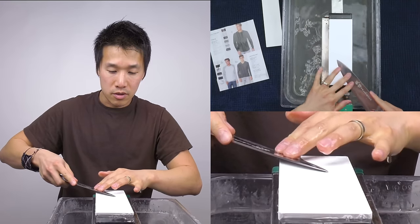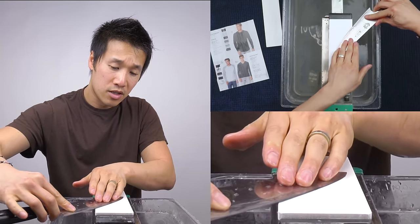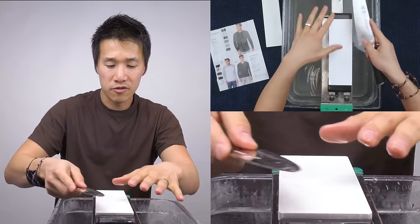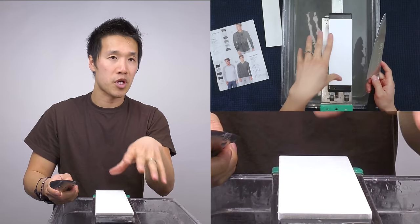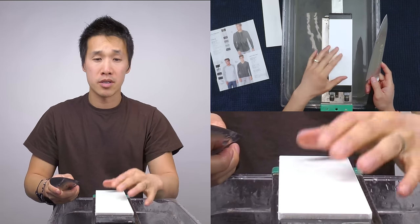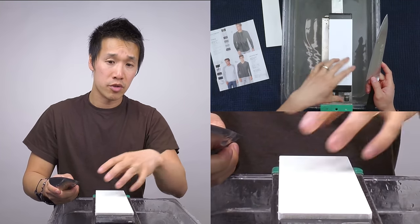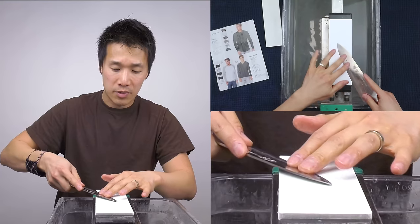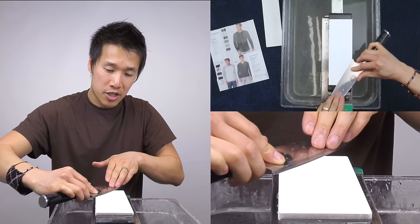Going very, very lightly. This is a really hard stone and it will always pick up some material. The harder the stone, the more material it reveals on the cutting edge. If you go to a softer stone — like a King 1000 or a Trocera — those allow the knife to pull off materials and fresh abrasives with every pass, and they tend to load up a little less than the Shapton Glass stones. Even the Shapton Pros won't have the same load-up issue as the Shapton Glass.